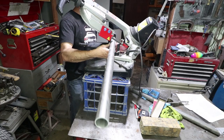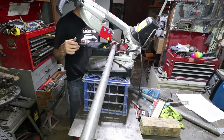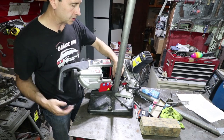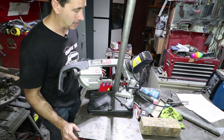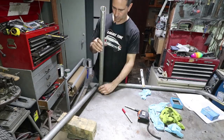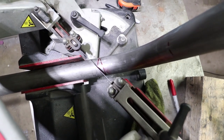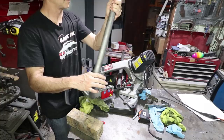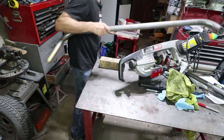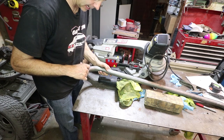I'm trying all kinds of creative ways to hold this in the saw. I have it lifted up so it doesn't hit the floor, but because the cut is so close to the bend, I can't shift it over enough. I think this will work, but all my marks are on the other side of the tube, which kind of sucks because I can't see them. So I'm going to have to remark everything and be able to fit it in the saw. This looks about right. I have the saw set up on those marks that I made. The band saw's done all I can do. There's no way I can clamp and make this last cut here, so I'm going to have to do that with my angle grinder.